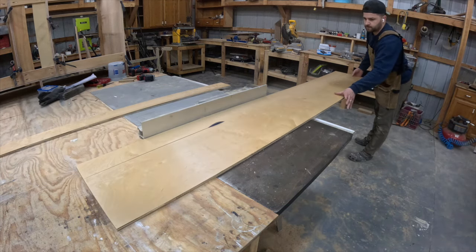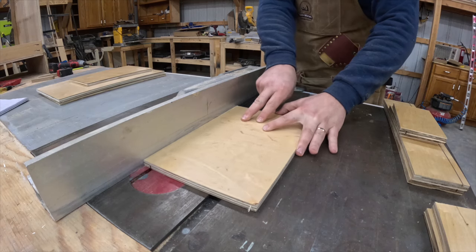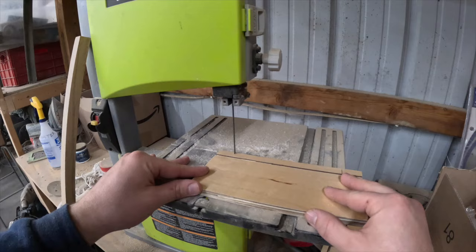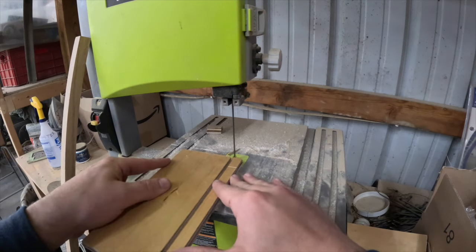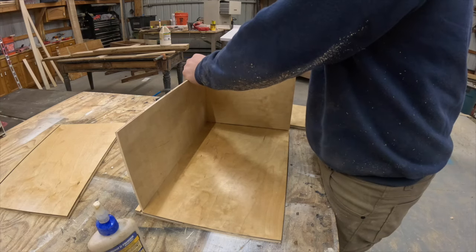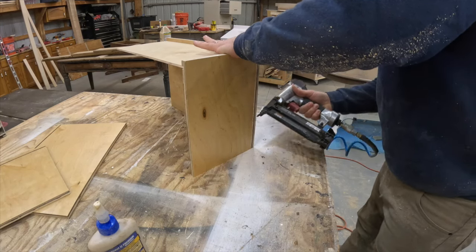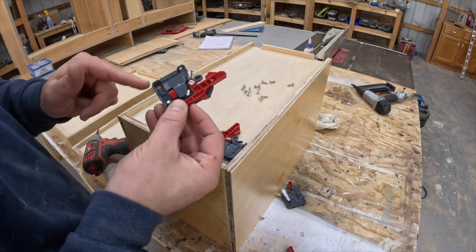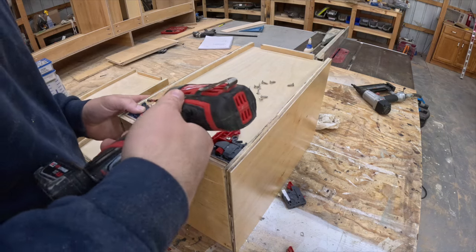Once all of the drawer slides are installed, grab measurements on how big we need to build the boxes. To make the drawers, I subtract an inch from the height of the opening to determine the height of the drawer. Once all pieces are cut, I cut a groove a half inch from the bottom of the drawer, a quarter inch deep, to accept the plywood drawer bottom. Because we're using undermount drawer slides, I need to notch the back corners of each drawer to allow the slide a place to sit — the bandsaw makes quick work of these notches. We then put the boxes together using glue and brad nails, sliding the bottom panel into the groove cut on the table saw. The last thing is to attach the drawer slide clips to the front corners of each box — these are what the drawer slides lock into, ensuring the drawer doesn't wobble.